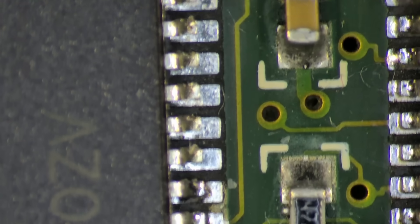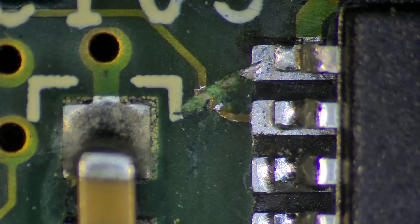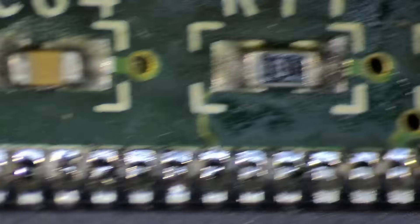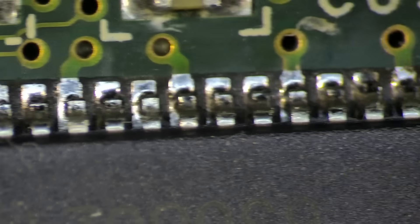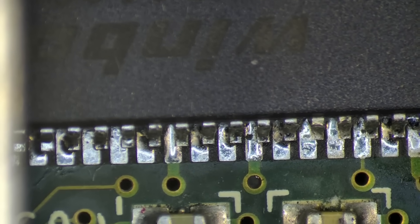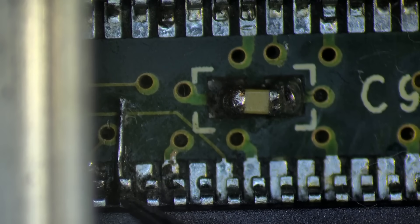And here we have bent pins, and they are not soldered either. This entire row here is not soldered. And here we have a broken trace. Here's another solder bridge. What are we going to do now — five solder bridges and countless unsoldered pins. I think the best course of action would be to take off the heatsink. Now we have misaligned chips as well — the pins don't line up with the pads. And here I think is a copper wire going through the via that we saw at the back of the card.